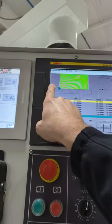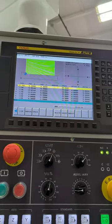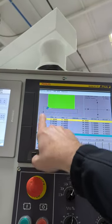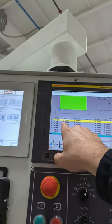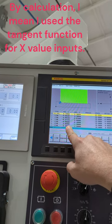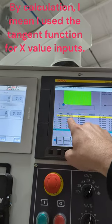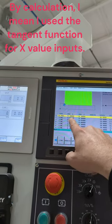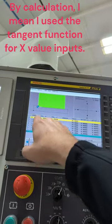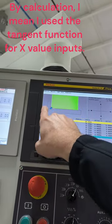I'm going to go this way, and it'll pay attention to what you're doing in the tool wear compensation and tool radius compensation. And so this next line, these are actually distances or depths. This is not diameter here. So I'm going to go minus. This is just a calculation of that angle that I'm putting on that wheel and eventually putting on the part. But yeah, so 85, and then keep that one the same. I like a nice square box path here.